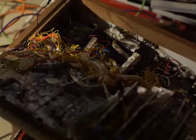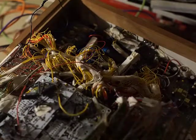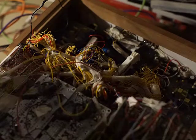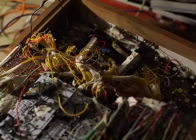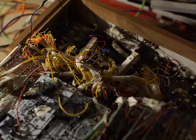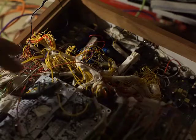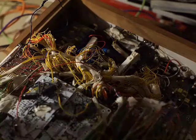There is not a pull down on the stereo to mono sum, because in this way we can use the mono also as direct out. The same stereo to mono sum is done on the output to get a mono output that is just the sum of the left and right channel.